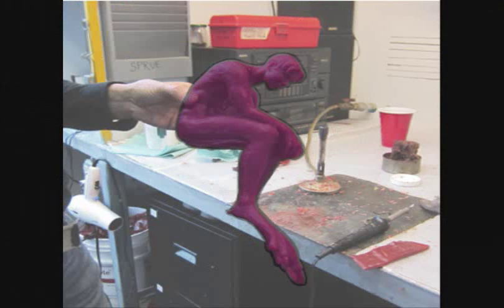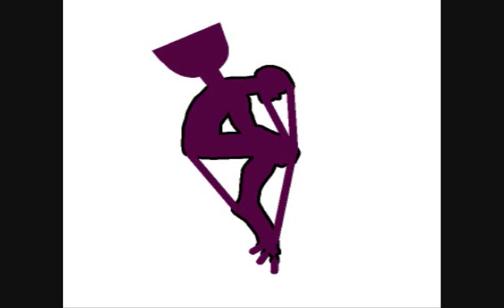Next, you have to attach little pieces of wax called sprues that will act like channels for the molten bronze and escaping air to travel through. You don't want trapped air bubbles in toes, for example, because when air takes up space meant for bronze, you end up with a toeless foot. A pouring cup is added next. This will allow for the bronze to flow more smoothly into the piece.